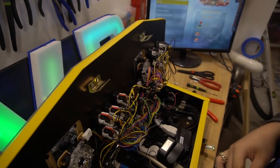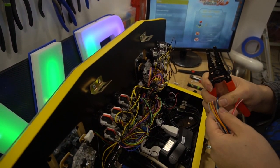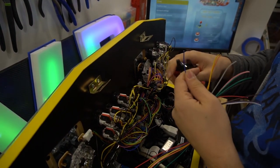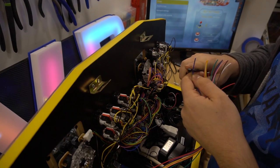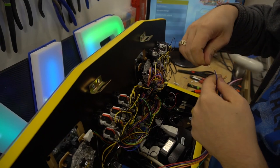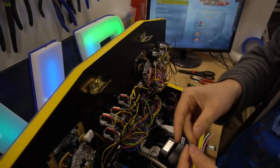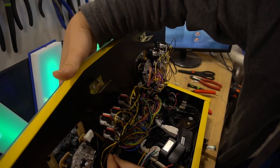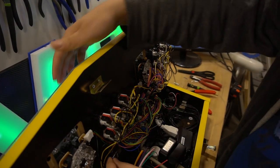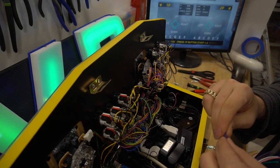Now the fun and hard part is figuring out which wire does what for each button. That's really why we need the I/O test — to tell what button does what. I already know blue was button A. We're going to be generous with wire length and get back into test mode. We're in test mode now and confirming — yes, we are working on player one.